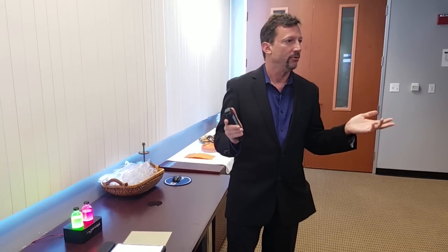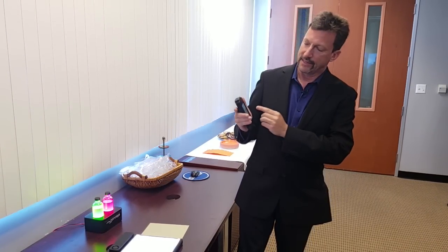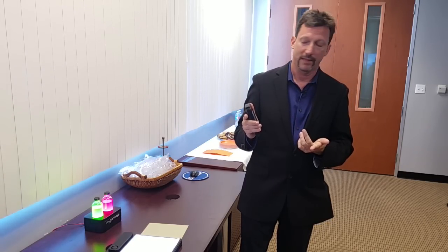This turns out to be not so bad for general illumination, because our eyes are actually looking for sunlight — reflected light coming off of surfaces. But if you have a three-color primary system where you're just trying to make red, green, and blue and vary the amounts to make all the in-between colors, this is not so great, because you have very little red power and your principal green power is in the wrong place.